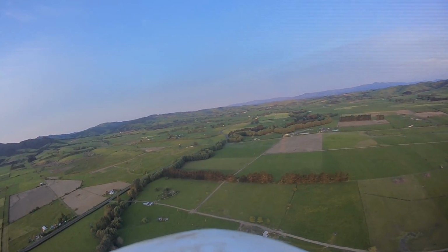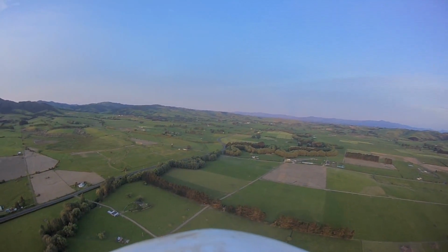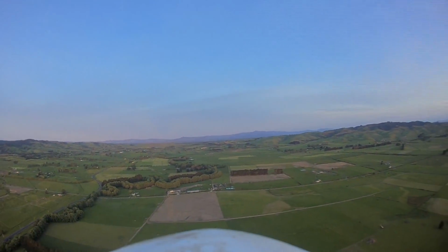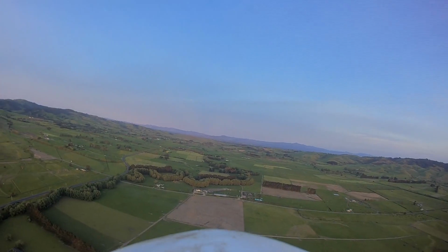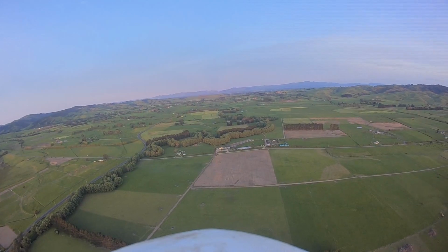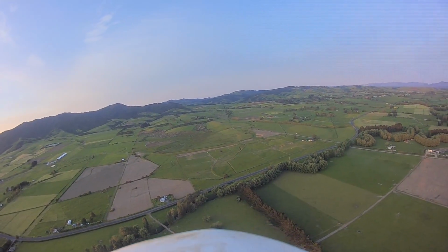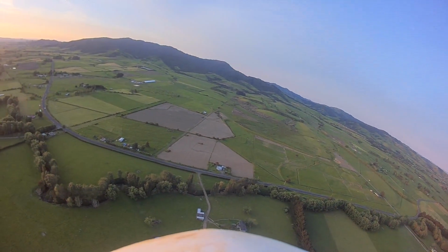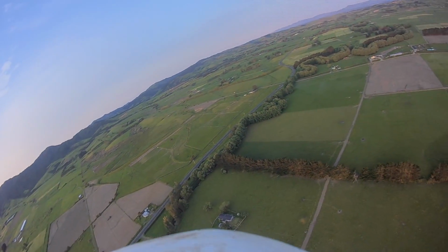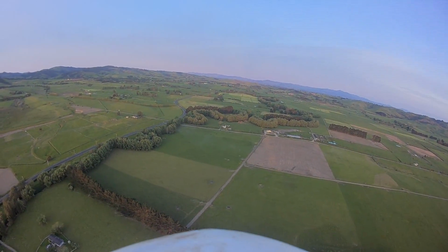Alright, let's see if I can record some values into the EEPROM about what I would prefer as a glide mode rather than those default numbers that I'm using. So I'm in stabilize mode or attitude hold mode, and I'm going to turn the motor off because that affects the glide slope a bit. And let's, oh, fully back on the stick. Alright, and I'm going to, right about there, I'm going to record those numbers. So it should be rolling to the right a little. Now I'm hands off again, gliding.